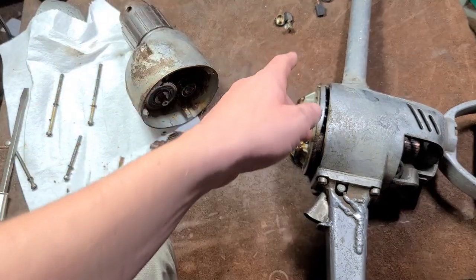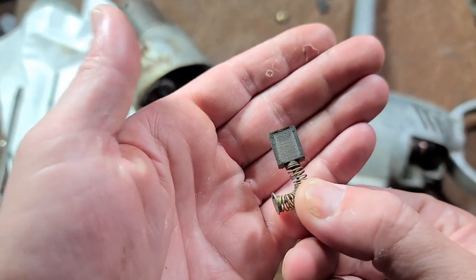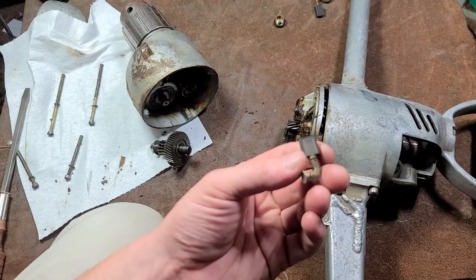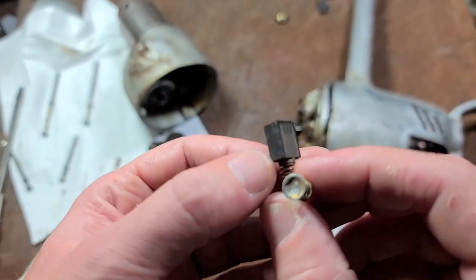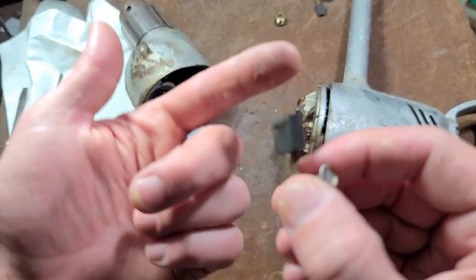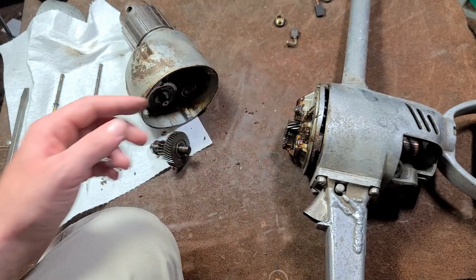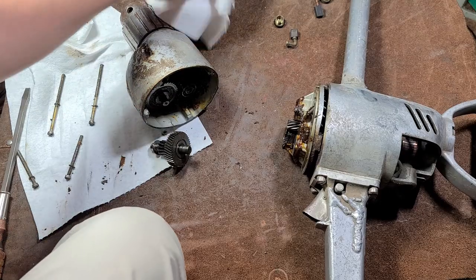You do want to pull out the brushes before you pull out the motor. Another quick tip: if you're going to reuse the brushes, you'll see that there's one side where there are markings from the brush guide and the other side they're not there — that indicates the direction the motor was rotating. Usually you'll identify the side with the wear as the thrust side, or you can see the sparking side, and you'll want to try to put the brushes back in the same direction they came out. If you ever forget, just turn the chuck — in a triple reduction it'll spin counterclockwise — and put the brushes in the appropriate direction.